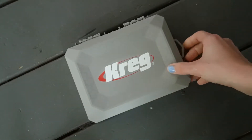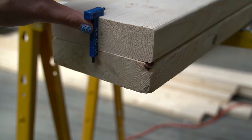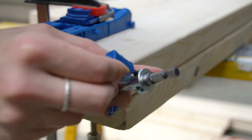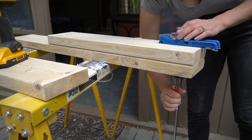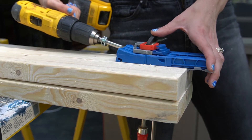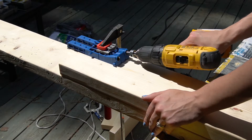Let me explain very poorly what a pocket hole is. You take this jig — I got a Kreg jig, which is what most people get for pocket holes. You put a tool that comes in the kit on the edge of your board to measure thickness. Then you set your jig and drill bit to match that thickness — for me, one and a half inches. Using a little clamp, you clamp the jig to the board and drill down into the hole of the jig. This creates an angled hole that you use a special pocket hole screw to join two boards together. I'll put a link in the description that explains this much better.